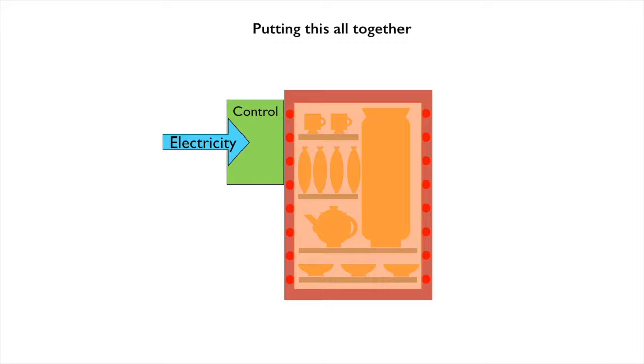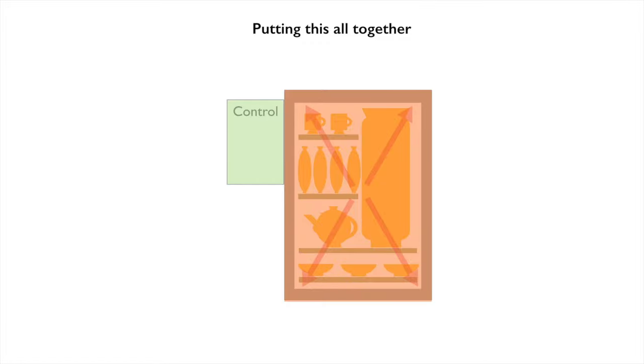So when we're cooling down, it's an inside-out process. Our heat source is now the inside of the kiln, and it has to come outwards. As it's moving outwards, it moves from the pots to the brick and to the side of the kiln, and then the air in the room collides with the side of that kiln, and all those particles start robbing heat. And that's how we're radiating this into the room. Okay?